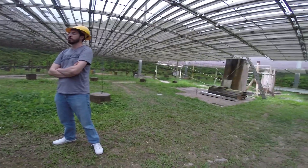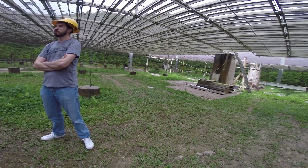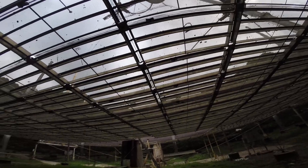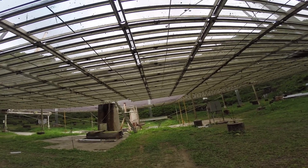It's like 10 percent bandwidth, so we could never go above about two gigahertz when we had the line feeds before this dome was put in. So in the 90s they took down one of the carriage houses and put the dome up there, which has two reflectors inside. The wave comes down, hits the dish, goes up through the focus, goes into the dome, and there's two reflectors that refocus at a point. You just put your feed right there on the point, and you no longer have any spatial problems with bandwidth or frequency.